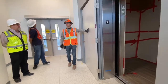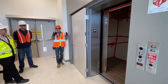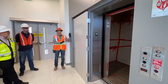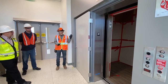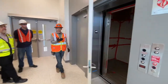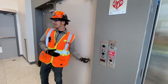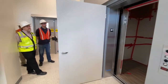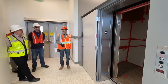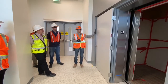These are different types of fire doors — just a hollow metal door, fire-rated with drywall, appropriate rating. These ones are simple. They're going to stay open all the time. When the fire alarm goes off, it's going to detach and the door — depending on the wind — should close on its own. There's going to be a lot of pressure on this door to get it to seal, because it needs to seal. There's no on-off switch, nothing to it — it's on a magnet. If the fire detectors are still on, this thing won't hold open.